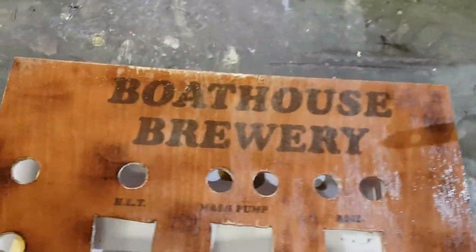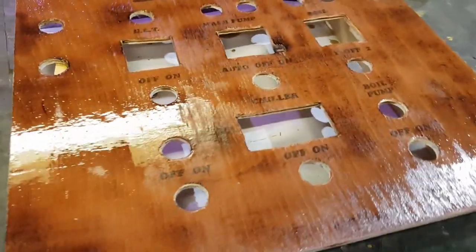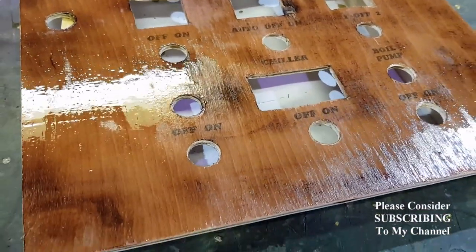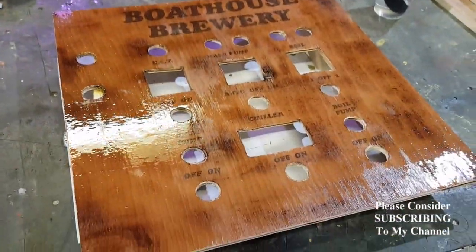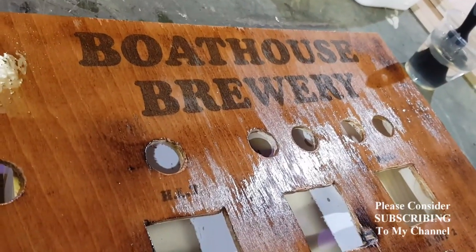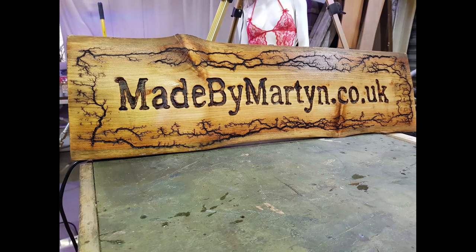That's it for today. This is a polyurethane varnish — I was going to use a waterborne varnish, but I find this is more durable and hard-wearing. Given that this is going to get a bit of a bashing over time, I thought I'd give it some polyurethane. That will take about a day to dry, and once dry I'll sand it down lightly and give it another coat, then another, then another. But until then, I think it's time to wrap this up: part one of the control panel build is now done.